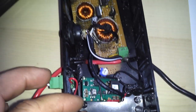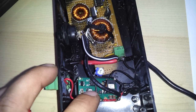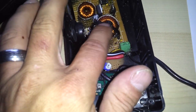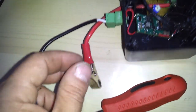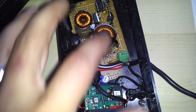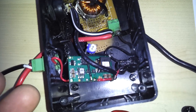The last thing I need to tell you before I stop this video: if you use a DC-DC converter, make sure before you turn it on and put power to the desulfator and the battery, you have the desulfator connected. If you don't, you will fry the desulfator with your DC converter.